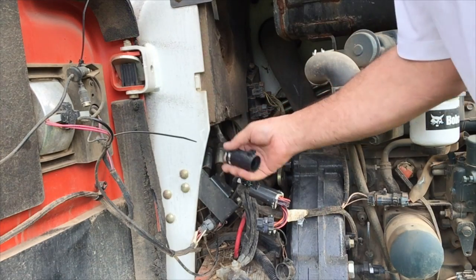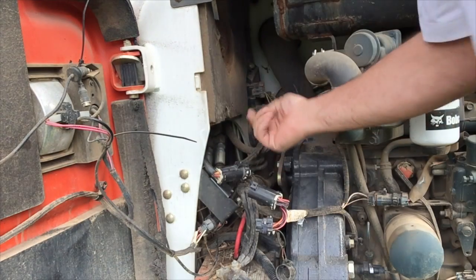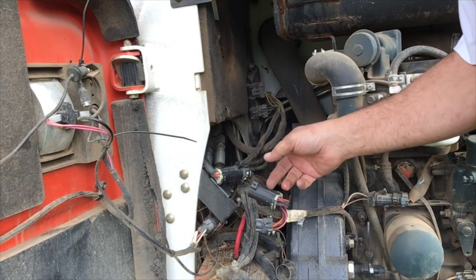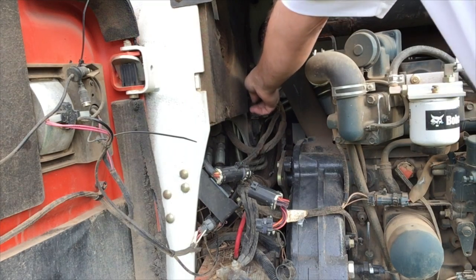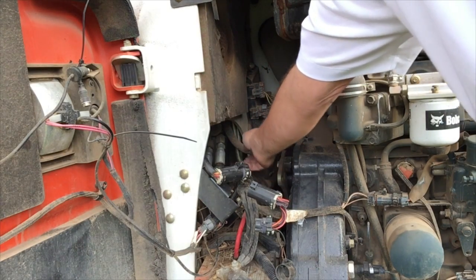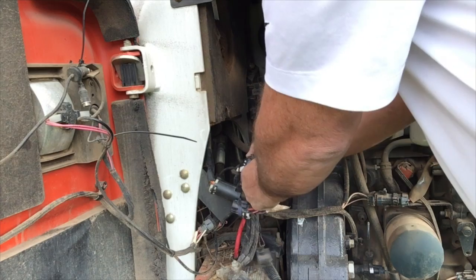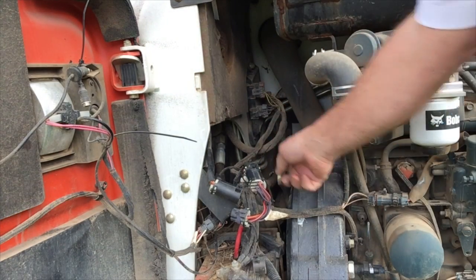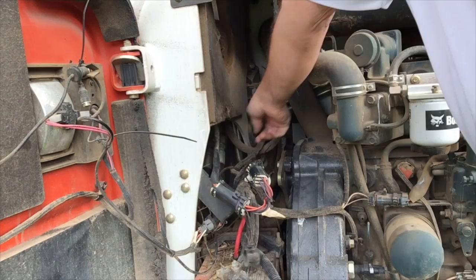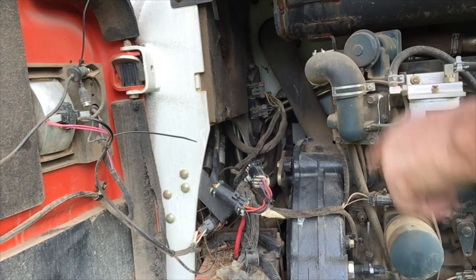Now here's what they do. If you only have the 7-pin, it's just plugged straight into the bus — that's it, nothing else exists. When you want to add the 14-pin, there's a little box that has magnets on it. The magnets hold it onto the side of the machine inside there. The 14-pin cable comes off and goes away, and there's a little Y-adapter. This Y-adapter plugs into the bus cable, so now signals are going through into this little computer, being decoded, and going out for the 14-pin and also out for the 7-pin — allowing you to drive both at the same time.